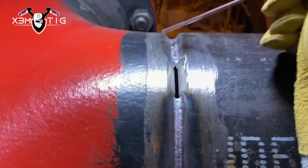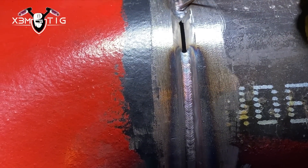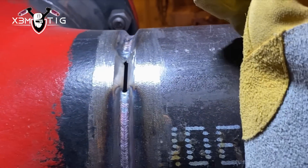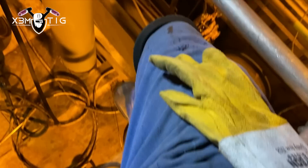After I pass that tack I'm just gonna pull it out slowly from the outside — I'm not gonna keep that rod inside. The gravity will do the rest. You just want to keep it out especially when you're going on the top. You can switch to dipping, or dip in the middle one-two-three. Now we've reached the top — already did that feather out on the top part. Now we're just gonna connect that tie-in.